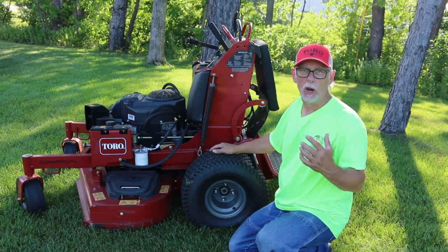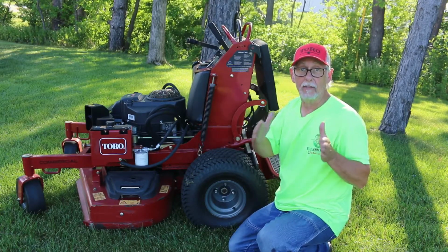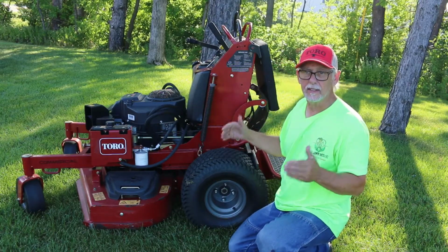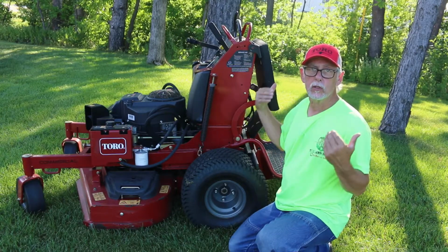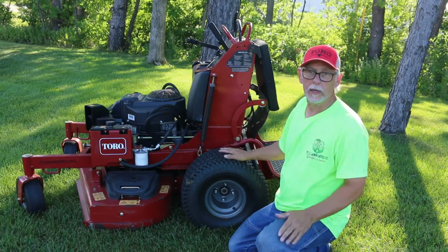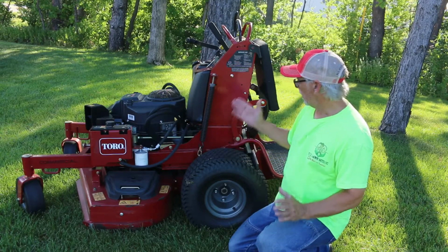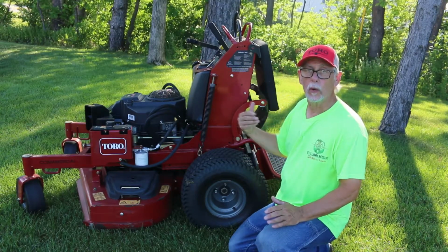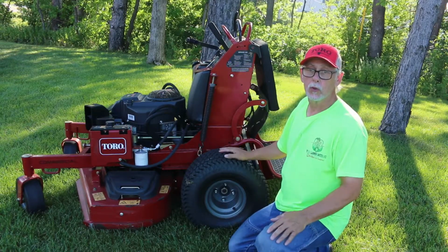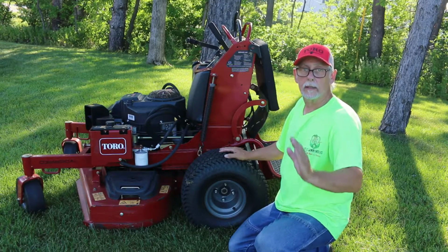Now, whether it be right or wrong, it's just what I do, which feels comfortable for me and actually works for me. And I feel real safe and stable on the unit. And again, the nicest thing about a stand-on is if you run into trouble, you can always jump off the back. So there's like a safety. Obviously, you don't want to injure yourself. You don't want to do anything dangerous or stupid. Get to know your machine, know what it can do, know how steep of a hill you can take, and you just learn this over time. But let me just show you on the hill that I have here how I run it.